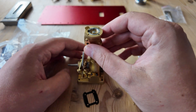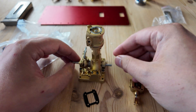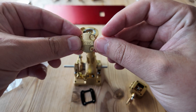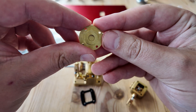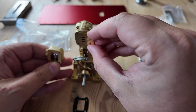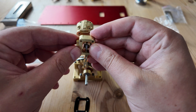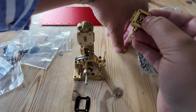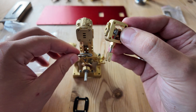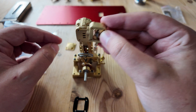I'd put the piston on the wrong way — it needs to line up with the reversing lever, so I've corrected that. The screw doesn't affect the throw, and the piston cover has a recess so it'll be fine once on. It is a slide valve mechanism — the slide valve goes inside the steam chest, there are steam ports visible, and all covers come with gaskets. So far so good; it seems pretty well built on the whole, though the linkage is a bit flimsy.